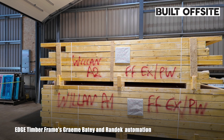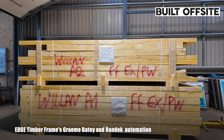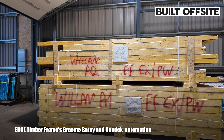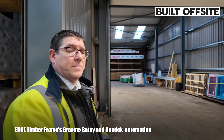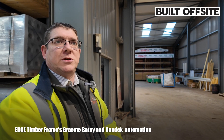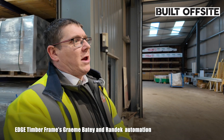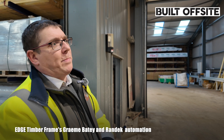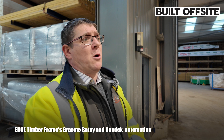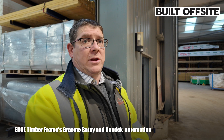These panels are ready for delivery — it's just down the road in the Lake District. That's two first floor panels for two plots, someone's house. A house — we could probably manufacture up to 20 a week out of this current facility working on single shifts. Start ramping up to double shifts or three shifts, we could obviously ramp up a lot more. We work in linear metres of wall panels — on a good day we'd probably do in excess of 150 to 180 linear metres of wall panels in an eight-hour working day.